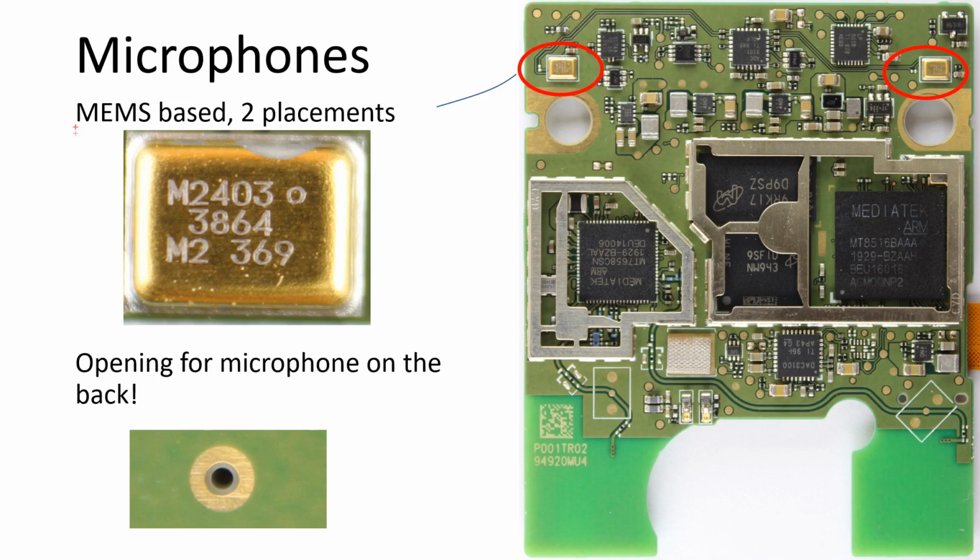Anyways, this is called a MEMS. It's basically a sensor that's built out of silicon, so they're pretty darn interesting to take a look at. There's a metal cap on the top, and of course, with the metal cap, you might ask yourself, well, how do you get air pressure into it? Interestingly enough, the microphone's actually in the bottom of the assembly, so there's a hole cut in the circuit board, and that allows the air to enter through this drill hole and up into the actual sensor, bottom mounted. I presume there must be some sort of mechanical advantage in putting the sensor on the bottom.